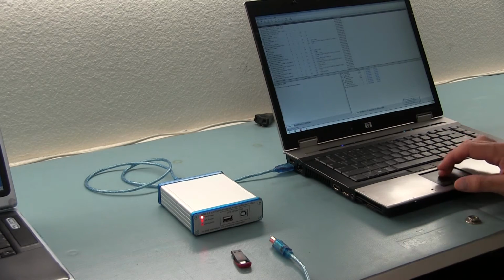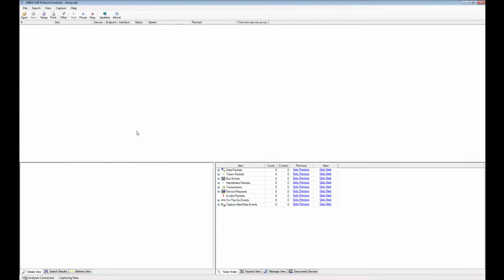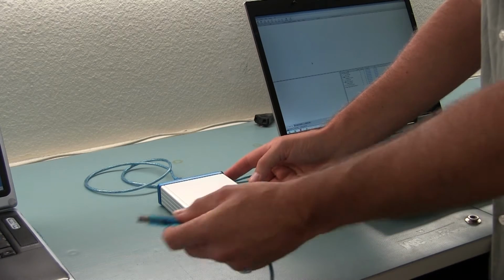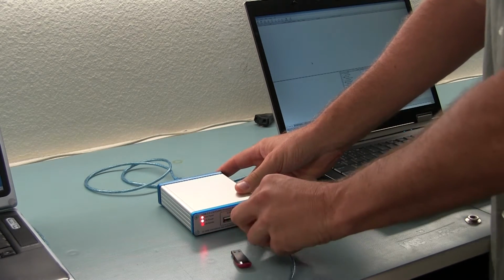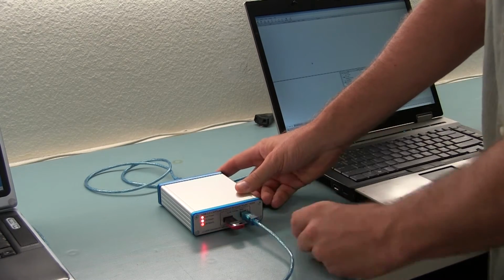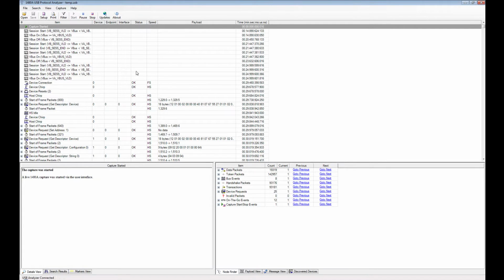Okay, so what we do next is go to the 1480A application, which I have running here with an old trace in. You simply click on the Start Capture button, and it says down there in the corner, USB analyzer connected and capturing data. Then you simply connect the cable to the host, and the host link power LED turns on. So off and on. I can do it a couple of times so you can see later in the trace that going on and off. Then you simply connect the flash key, and you have communication. It immediately shows up in the window over here.